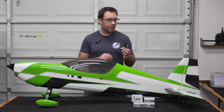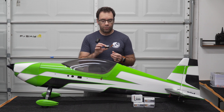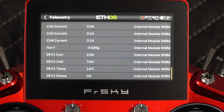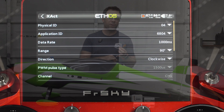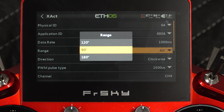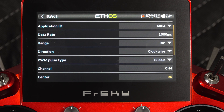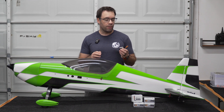More interestingly, I think it's the fact that if you're using a FrSky system with these servos, you get full telemetry from them — voltage, current, temperature. And on top of it, you're able to program a couple of parameters like the center point, the direction, the rotation angle — you can go from 90 degrees to 120 degrees, all the way to 180 degrees. There are also a couple of other parameters you can tweak to get the servo to behave just how you want.